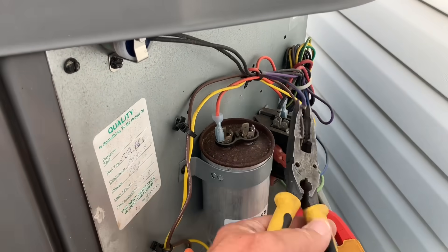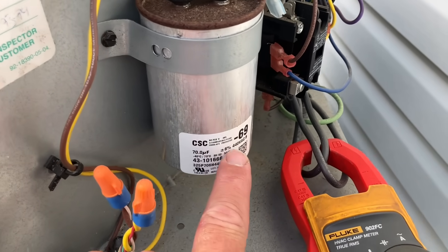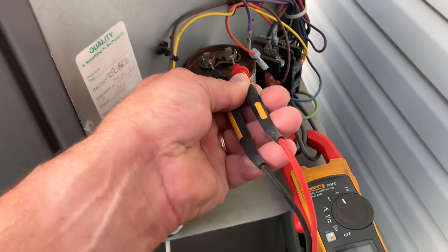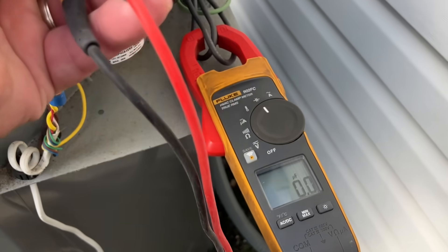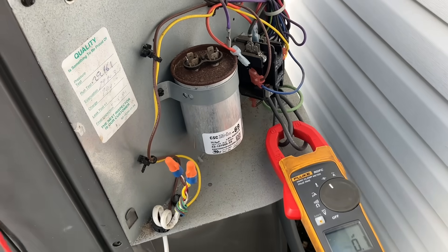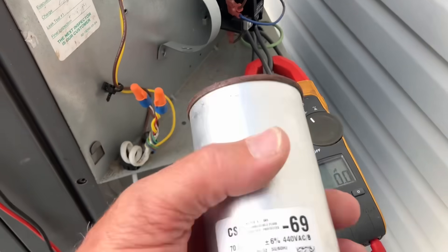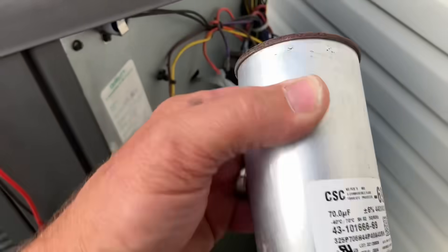Using leverage, pull that wire off and pull that wire off. This single capacitor is 70 microfarad at 440 volts. I have a multimeter here and we're going to test it by setting it to read capacitance — we get 0.3, 0.4. Yep, essentially nothing. Let's remove the strap holding this capacitor in place. There it is — and you hear that liquid in there? She fails the shake test.